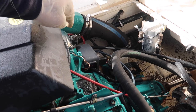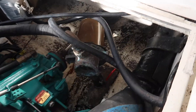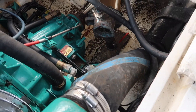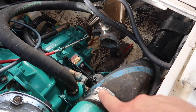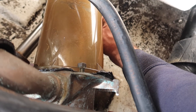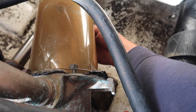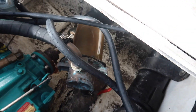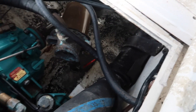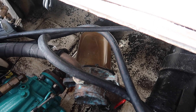Wait until the water has fully drained out of each manifold and each block. In the meantime, if you're doing this on an inboard, your water intake comes through a through-hull fitting, so your strainer will be full of water. On the bottom there's a plug you can pull out. There we go — the water's draining out. Most will drain but some will remain, so pull that plug out too to make sure it's fully drained, otherwise it will crack and break.